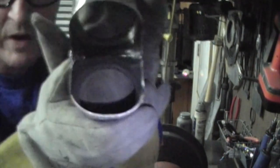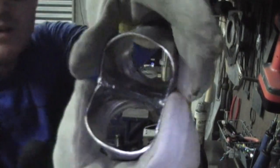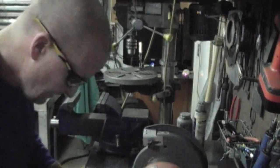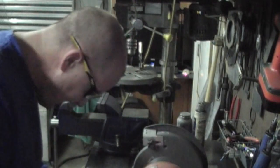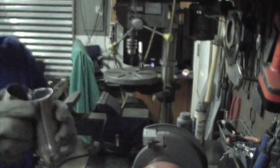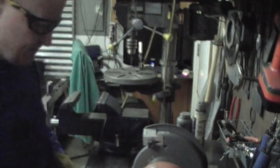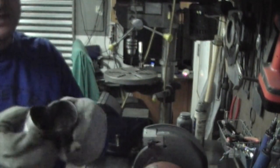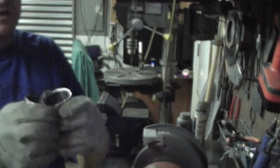You'll see what I mean by that, how it's now kind of squared on the outside. And take and drop that over top of the flange and see, yeah, we're kind of getting there. So what we gotta do now is just cut this off. And you can measure the circumference of the flange, the hole, and transfer that over with a tape measure on this thing.